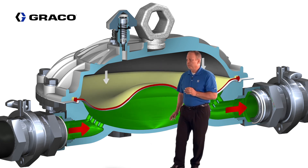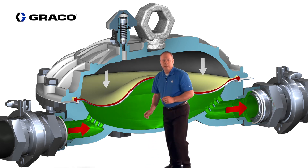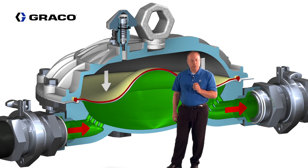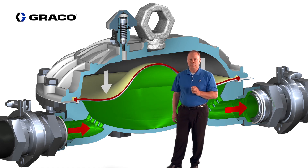Also notice there appear to be gray areas at the inlet and the outlet. These were designed to prevent the bladders from pushing into these areas when the suppressor is not charged properly. This design is not ideal for fast and efficient flushing.